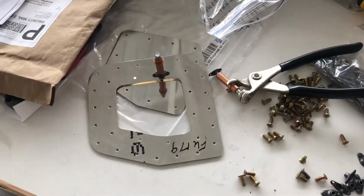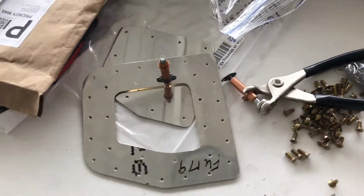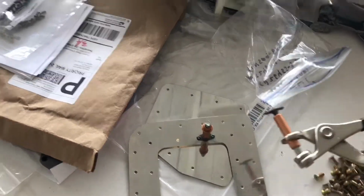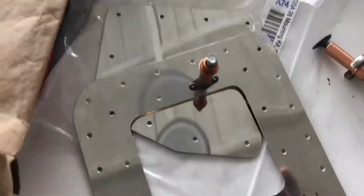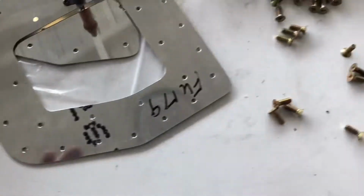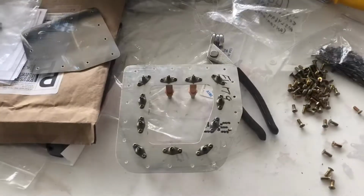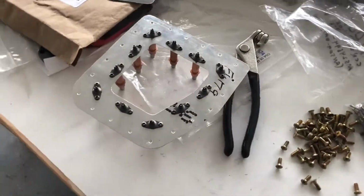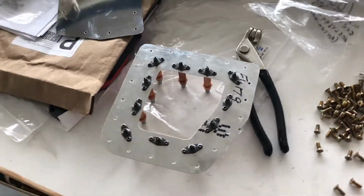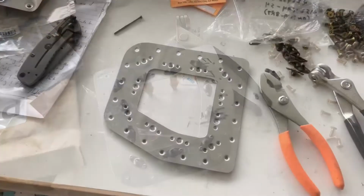So we've got the aluminum parts back off, and they're deburred, and now it's a matter of taking these clecos and putting those nut rivets into the places they're going to go, so that we can mark and drill the holes for the small rivets that hold those in place, the cherry rivets. So there we go, we're set for drilling the holes for those little cherry pop rivets, and then we'll be able to get those nut rivets put in place.